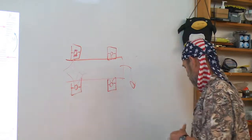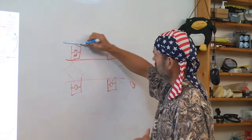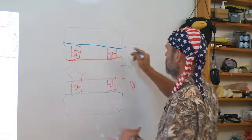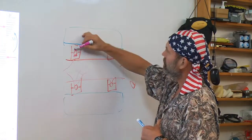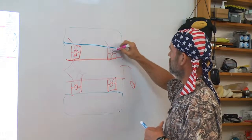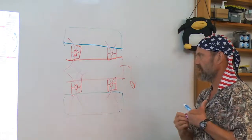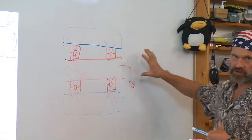And when you have an outside structure, the housing, this heat on the outer bearings goes into the housing. I haven't properly mounted the bearings in terms of axial motion yet, but we will in just a second. Okay, now the way I've drawn it here, this housing with these bearings, it's not stable. Actually, the thing will slide.